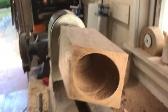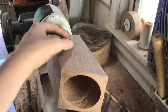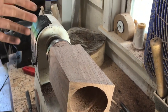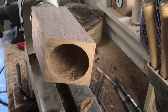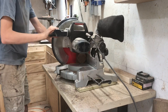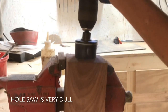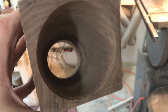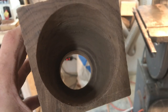Now I'm going to take this off the lathe and cut it off at the bottom. We're going to have a little bit of space that's not hollowed because I can't reach that far with the tools. Then we're going to poke a little hole in the bottom with a Forstner bit and go around it with a flush trim bit to get it to the same as the inside. You can really see how there's like a step down in there — we'll go around the inside with the flush trim bit, clean that up, and then we can see if our light fits.